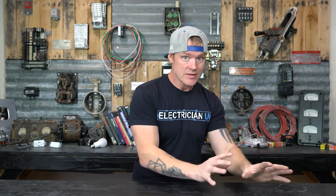Now let's talk about what a fault is. We hear 'ground fault' and 'arc fault' — a fault is just an unintended deviation. Current is going somewhere that it really shouldn't be. As electricians dealing with electrical circuits, we're trying to ensure that current goes very specifically where we intend it to go, because electricity is so dangerous.